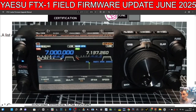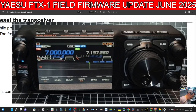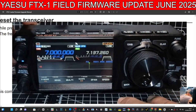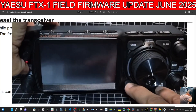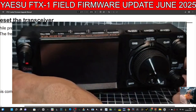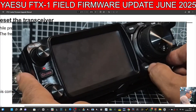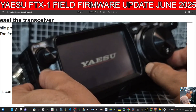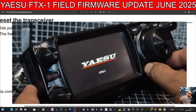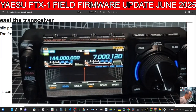Factory reset is nice and easy. It's the bottom two buttons underneath the VFO — Fine and Back — hold those and turn on. Turn it off, then hold them down and turn it on. Yes — that looks like a factory reset. Let's get an antenna on there.